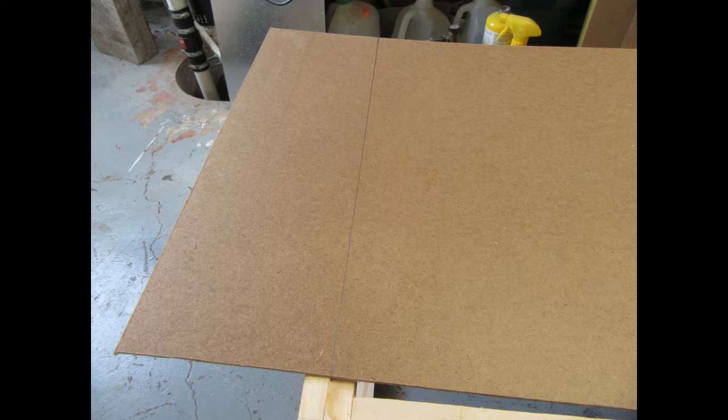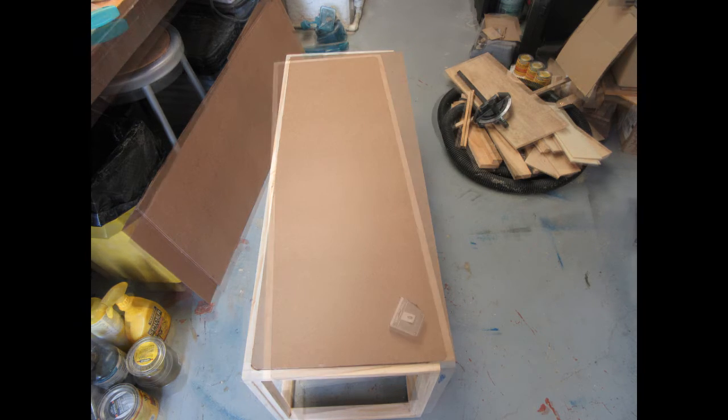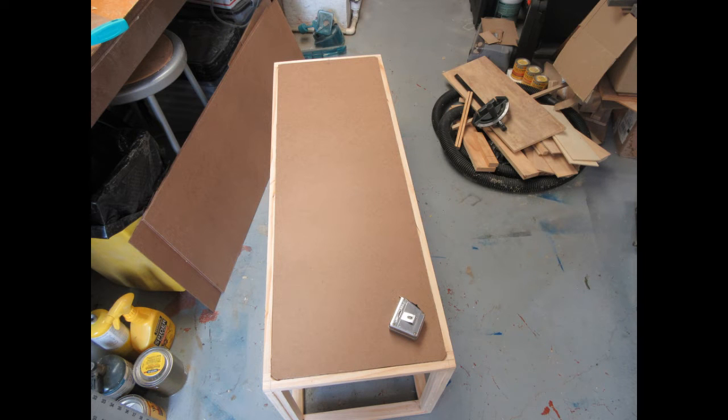the two marks. I use the table saw to cut the panel along this line, and now 3 sides of the panel will fit the inlay. Note that I have to trim the corners as I go along. Using the same technique, I mark and cut the 4th side of the panel, and now the panel fits well into the inlay area of its frame side.